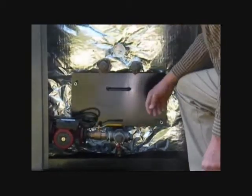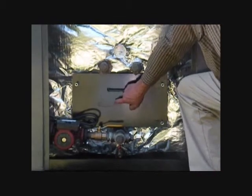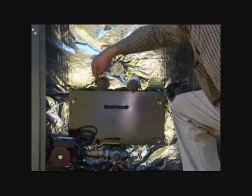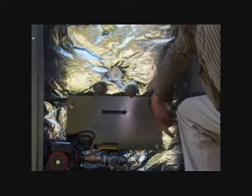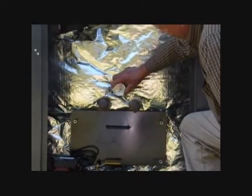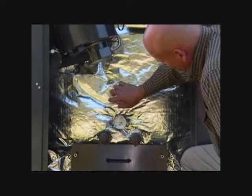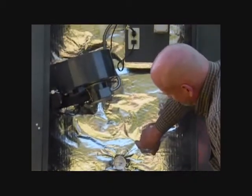The insulated rear access panel is designed to simplify maintenance and provide easy access to the catalytic converter system. Return water feeds into either of the upper ports. Water inlet temperatures are easily read using the pull-out style thermometer. The reflective face insulation provides superior thermal protection.